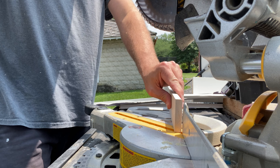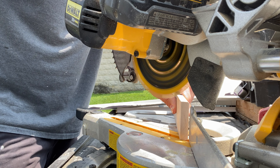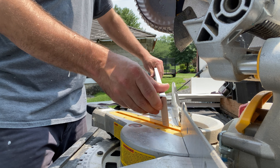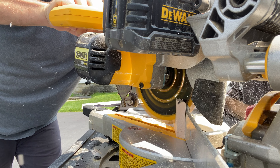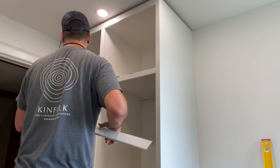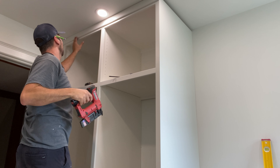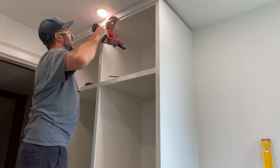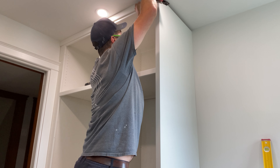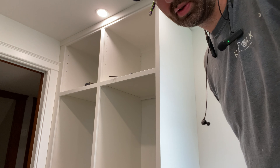I'm just going to do a test cut to see if I kind of blow the paint apart or anything like that before I cut to my mark. That cut very, very clean, so I'm going to go ahead and cut to my mark. We already marked the short point of this side, so this one is ready to nail. I'm just using a 23-gauge pin nailer to tack this up here — leaves a very minimal hole that I don't need to really do much with. I'll put a little white filler in it, a wax stick. Now we'll go cut this piece and install it.